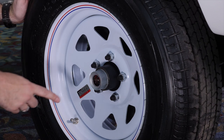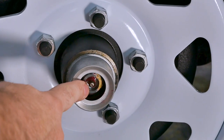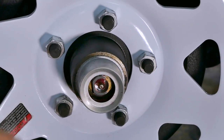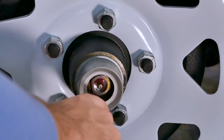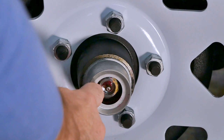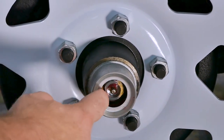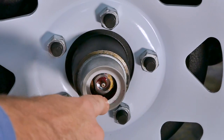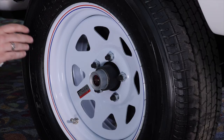You'll attach your grease gun to the Zerk fitting and then apply firm pressure to the grease gun. Add grease until you see the old grease starting to accumulate in this little trough right here. When the old grease starts to come out, you'll notice the new grease will follow it — and that's when you stop.